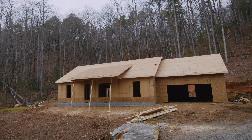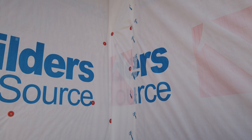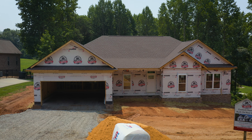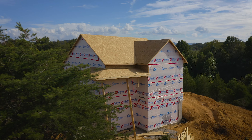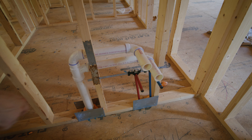A lot of builders used to just do everything over OSB. Wherever there's a seam, it is required to be taped per manufacturer specs to complete the warranty on the house wrap. Once the house is complete and framing with the house wrap on and completely dried in, that is when America's Home Place production manager will come do a framing inspection to proceed to the next step, which is mechanicals.